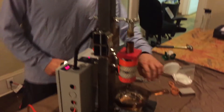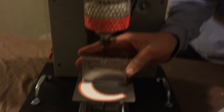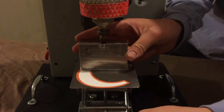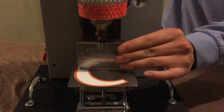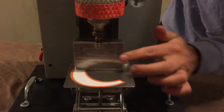First step: remove your collection pan, place your mold, raise it to the nozzle. Submerge the nozzle. Make sure that your mold is clamped. Ours were stolen, so we are using tape for now around the sides temporarily.